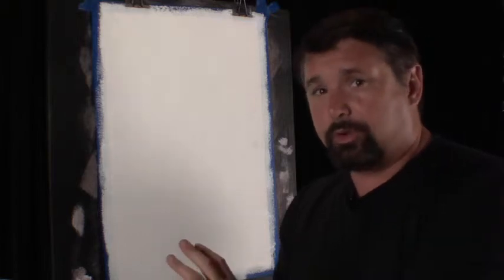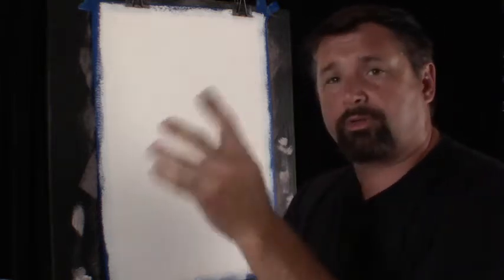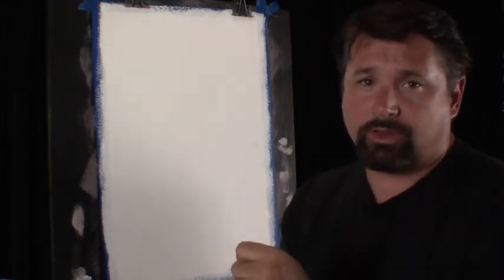Faux stone is an acrylic plaster, interior, exterior plaster. It doesn't have to go over the quartz primer. It can go over top of any flat primer for interior use. If you're going to do it outside, you've got to use the quartz primer. We won't stand behind the product if you use a different primer underneath and put it on the exterior of a building. If you want the warranty of the product, to make sure that it's not going to fail, you've got to follow the steps: quartz primer, Faux stone, and a proprietary top coat. That way you're guaranteed it's not going to fail.